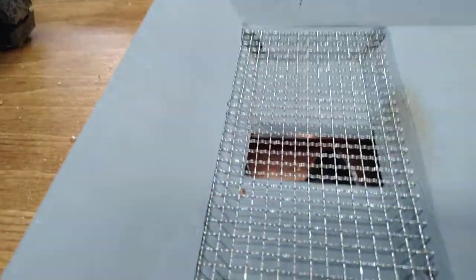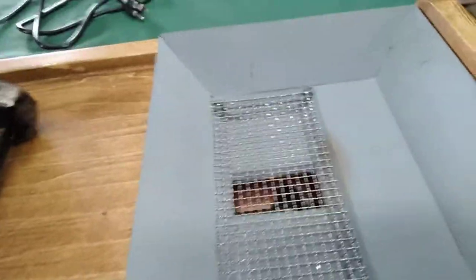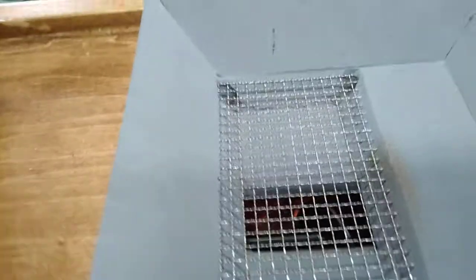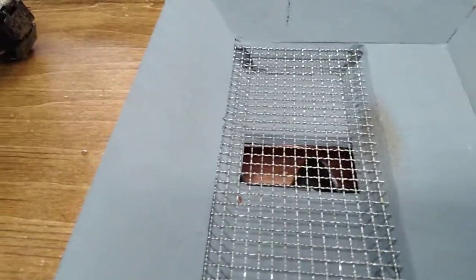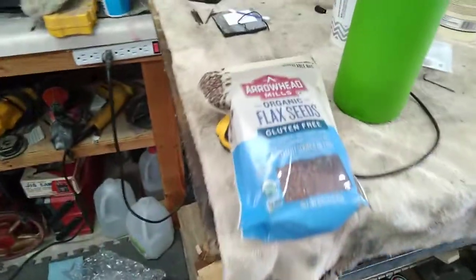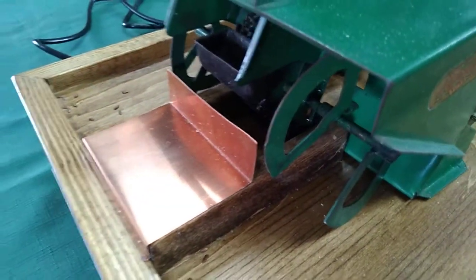It runs the whole length of the box and it's torquey enough that I thought it might catch a child's finger and really do some damage, so I put a screen on top of it. I took two earth augers — they're inch and three quarter round — and combined them both so I could get all the spirals I needed. It's in a two inch copper pipe. I run flax seed through it, and that seems to be the best medium I've found, because it's a little bit slick and doesn't compact when it gets to the end, and it helps it bubble up down here to feed the buckets.